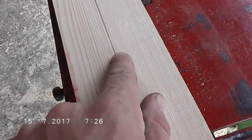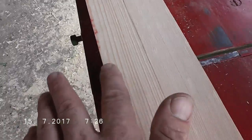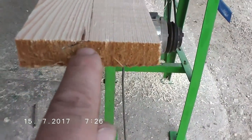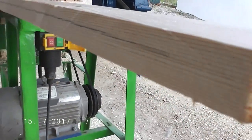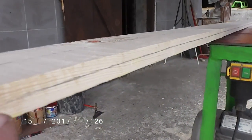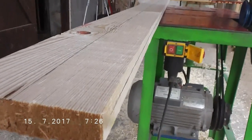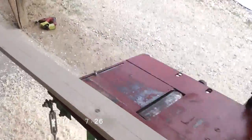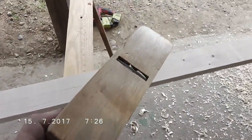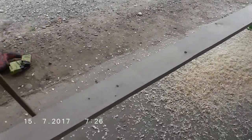You can see the side lines going all the way — 10 millimeters on both sides. This center line shows me where the highest point is, so this is the material I have to shape round, from this side line all the way around to the other side line — shaped just like this. The next step is to use a hand tool and make the round shape by hand along the whole four-meter length.